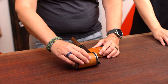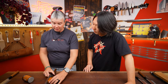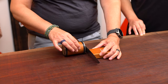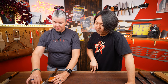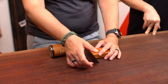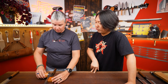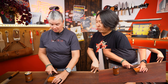You want to make sure the block is right in the middle of the blade because it was pushing it off. The instructions say to use really light pressure - it should be effortless, and it really is. It sounds like it's doing something. I did about eight strokes and there's a burr there now. The instructions say to flip it over and use the smooth side, so I'm going to do 16 strokes.